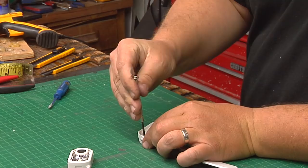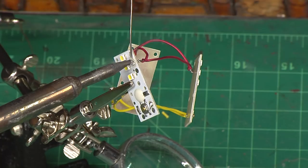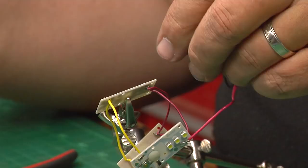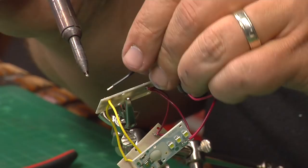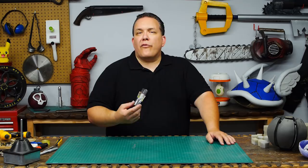Now I'm worried about the energon core's weight, so I disassemble all the LED headlamps, and what I want to do is solder them all together to one battery, and if I could bypass the on-off buttons, then I would put in one switch to turn them all on and off at the same time. But the resistors needed for the LEDs are right next to the buttons, and I can't separate them. So I really wanted to Frankenstein together some sort of lightweight, light center for the core.